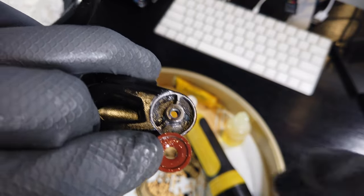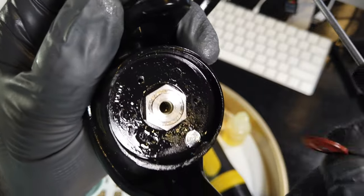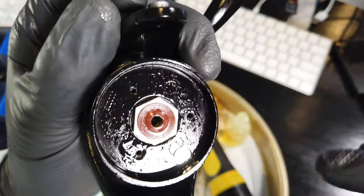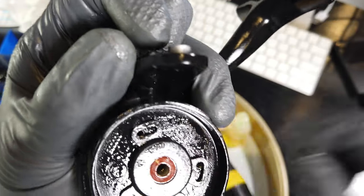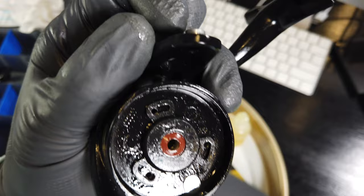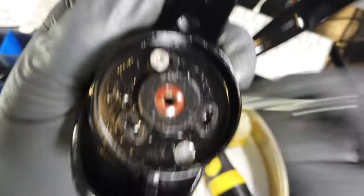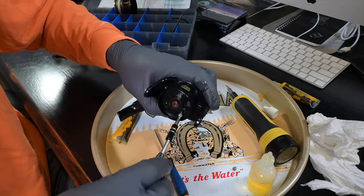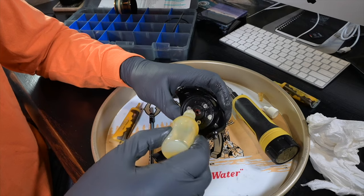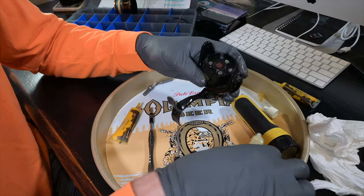There's our main shaft seal — the walls face down and fit into the channeling on the rotor nut; make sure that's all greased up. Then place the rotor nut locking plate and tighten down those locking plate screws. I like to oil up the screws in the threaded areas and down in the shaft area as well.